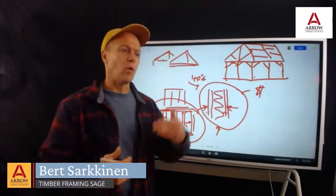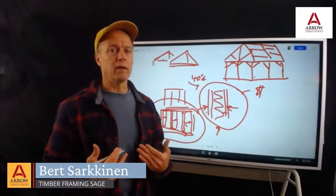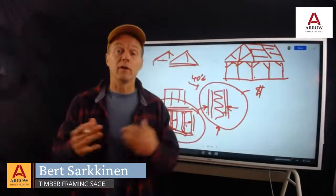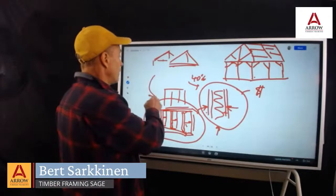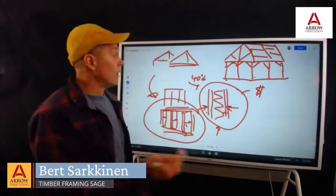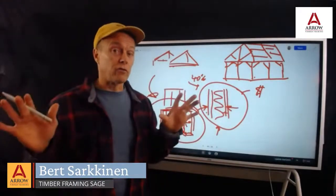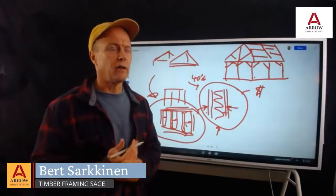So that just-in-time ordering and getting those short lead times really is the builder's friend and the owner's friend as well, because they don't have to make decisions so far in the future. When they get out on site, they may be sticking lights here, lights there. Maybe they want to shift this window. That all plays to the strength of conventional building with the blow-in insulation. The SIPs do have a pretty long lead time. And if you have a lot of different jogs in the structure, SIPs are really going to struggle with that.